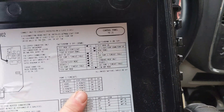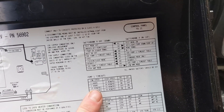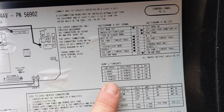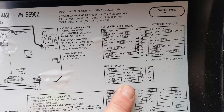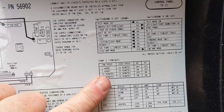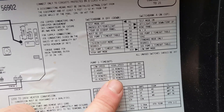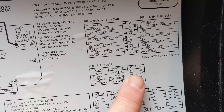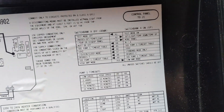And there's pump one timeouts — there's low speed and high speed: 15 minutes, 30 minutes. You can change this on the VS. When you turn your pumps on, it only runs for so long and then it turns off. When you're in on high speed, you can set it to 15 minutes or 30 minutes. So high, low — there's your pins, A5 and A9. Just follow all these schematics and where the pins are going to go.